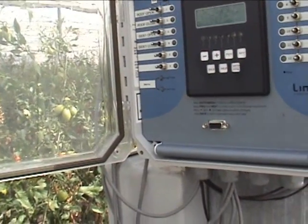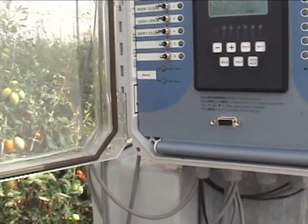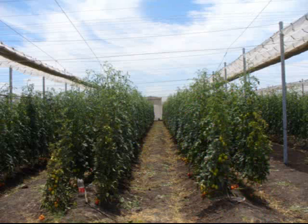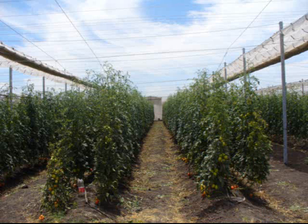just right, or too hot. For example, when the outdoor temperature is below 16 Celsius, the roof will close to protect the plants from the cold. When the outdoor conditions are above 16 Celsius, the roof will retract totally to expose the plants to the natural outdoor conditions. The plants will now receive higher light levels, direct exposure to infrared, UV, and full levels of PAR light, and will experience a higher transpiration rate.